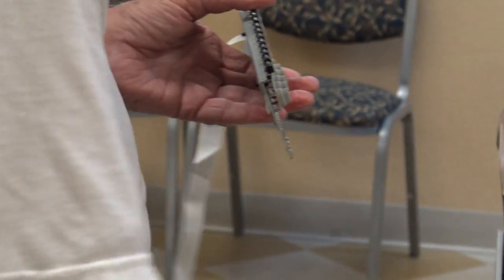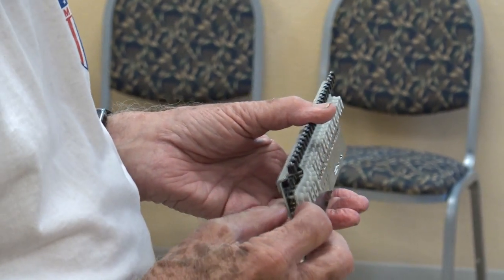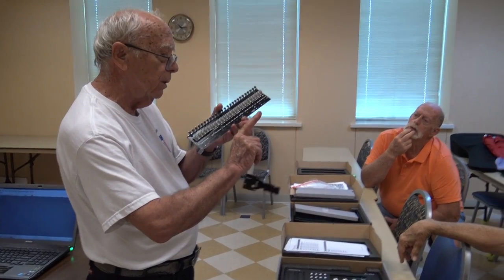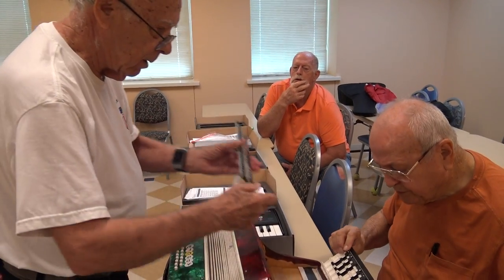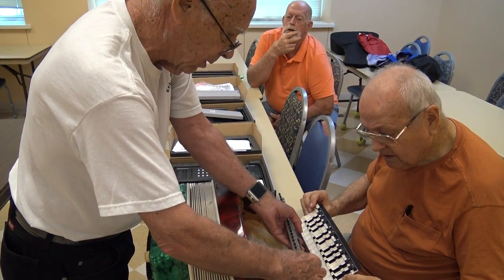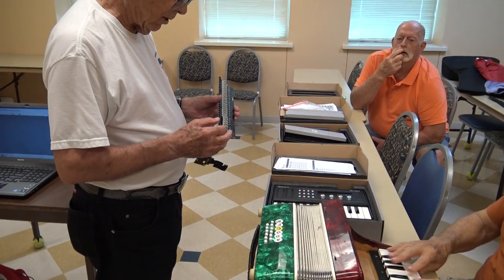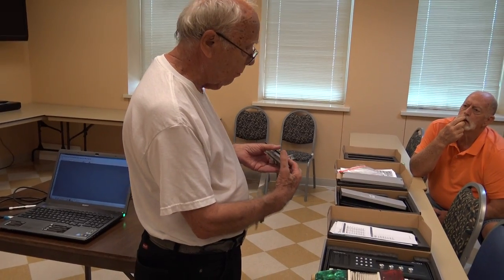You've got 25 keys. The problem is each of these that you can see has two holes — one shorter than the other. So when you push it down, there's a time difference between when this one is pushed and when that one is pushed. Those then will push on the contacts underneath. This is the same principle as the keyboard we're using, or any keyboard — it's been around for quite a while.